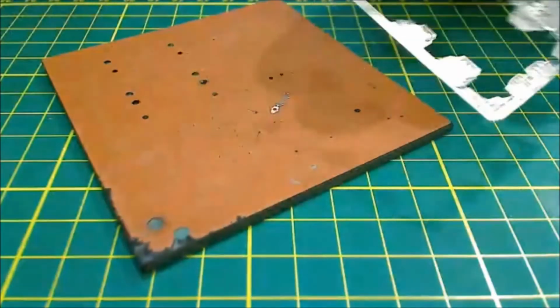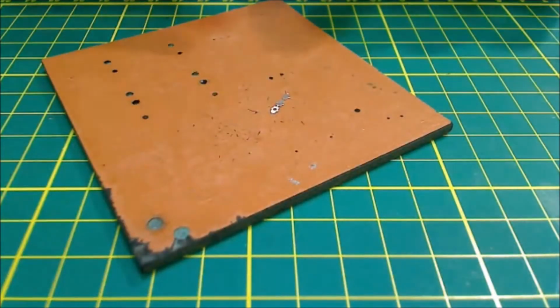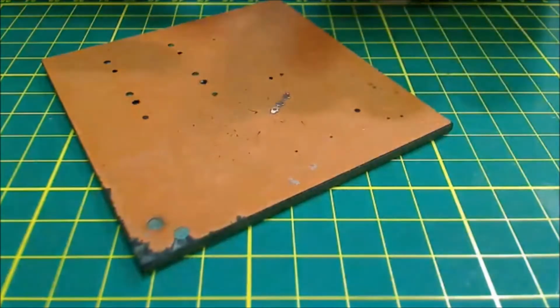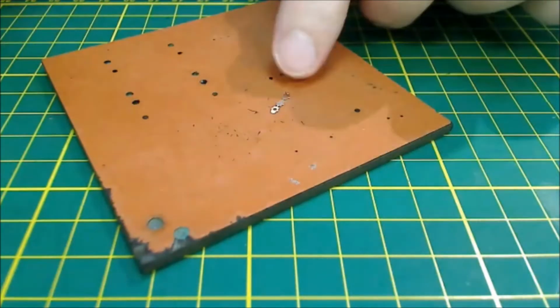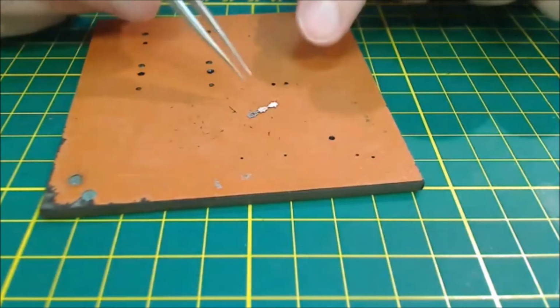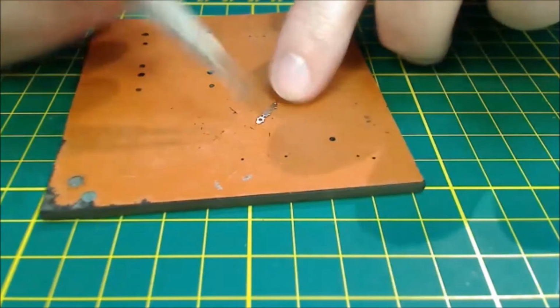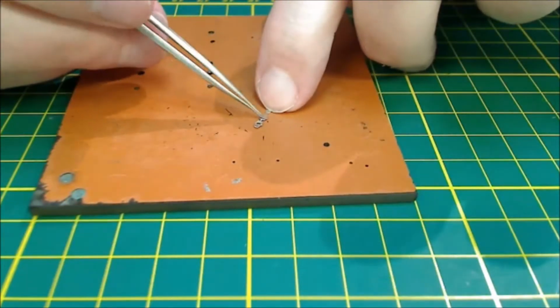And yesterday, I showed you the method with the sole bars where I tinned the parts and then folded them up and put heat in from the edge to sweat them together, and heat from the back to sweat them together. This time I'm going to do it the other method, as I promised, where I'm going to fold these up kind of like a sandwich with flux in the middle.